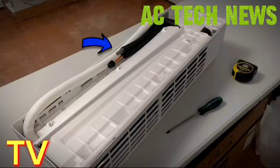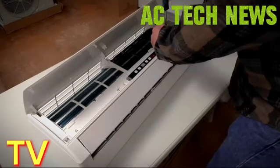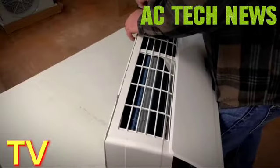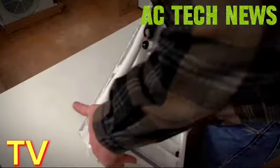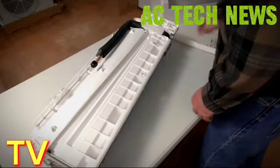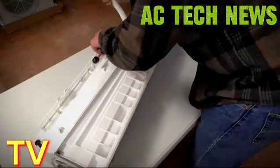In this case, we will move the condensate drain tube from the left to the right. This requires removing the outer cover of the air handler. Open the service hatch and remove the four screws across the front and the fifth screw in the center bottom. Turn the unit over and release the four locking tabs. Carefully lift off the cover and turn the unit over to expose the drain connection. Unfasten the retaining clip for the drain hose. Next, locate the rubber drain plug on the right side, remove it, and use it to plug the left side drain. Replace the hose on the right side drain and fasten the retaining clip.